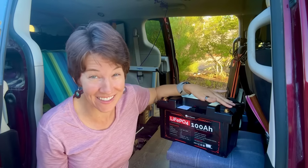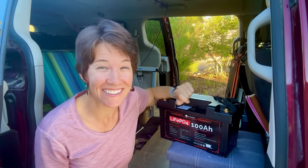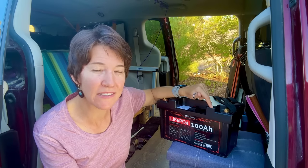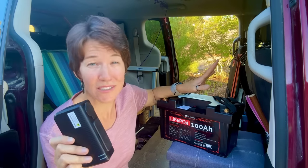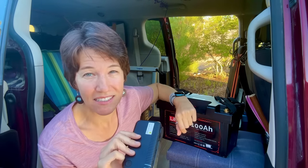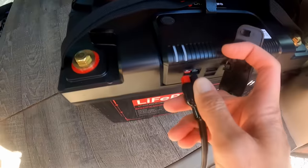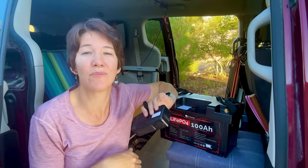There's also a 10-year warranty on this battery. Some other YouTube channels tested the capacity — my favorite is Hobotech — and he shows the battery does indeed have 100 amp hours even when used with this hub. The only bad thing I could find was about the hub. Some people said it burned out prematurely. If I was going to rely on this in the woods for a month, I might buy an extra hub just in case. But the hub does have a 12-month warranty. Perhaps those bad reviews were from people plugging in their laptops and using it incorrectly. It does say it will get hot if used at full load for a long time. Using 7 to 10 amps for an hour will trigger high temperature protection. My Alpacool freezer only takes about 4 amps, so I should be able to run that for a really long time with no overheating.